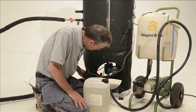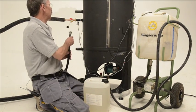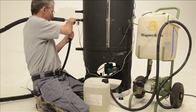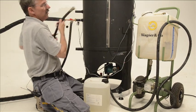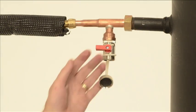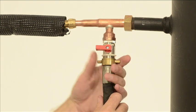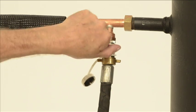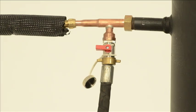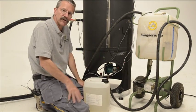We've connected the pump to the return assembly on the bottom of the tank. We're going to take another hose and connect it to the supply assembly, and feed it back into our tank. Both the supply and the return assemblies have a place for hose connection for filling or draining, and a valve mechanism to drain or close the system when you're done. We're going to turn the pump on and just let it flush the heat exchanger for a couple minutes.